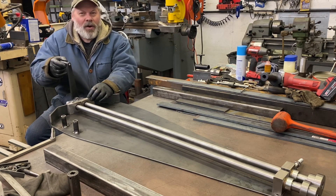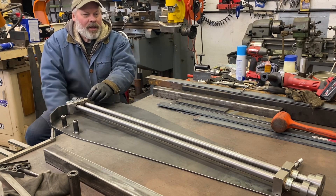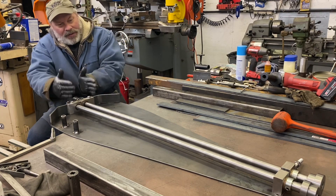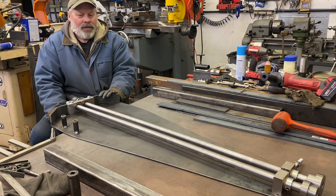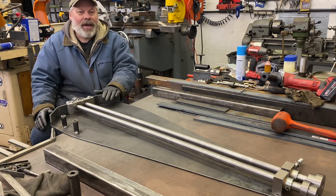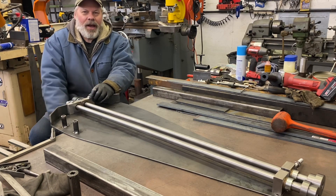This is a handle I had left over from one of the bead rollers I got, and we're on our way. Now I'm going to extend the square tubing and extend the piece of flat bar that's going to go the length inside, weld that all up, and the final step will be putting the skin on the outside and hooking up the front bearing blocks. But the rear is done.